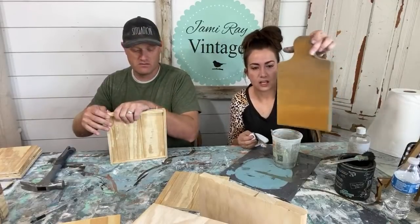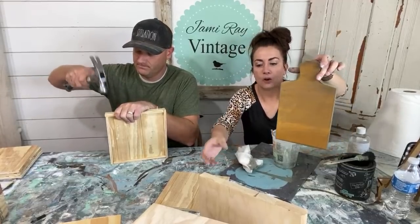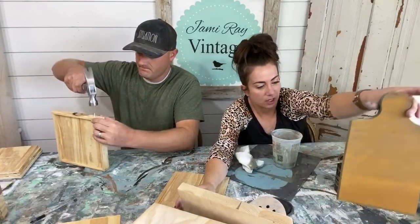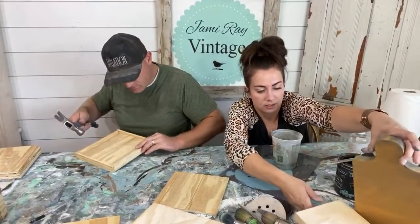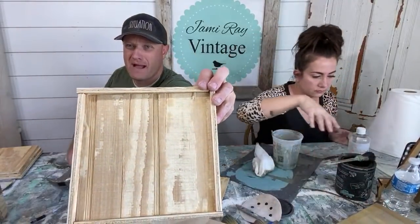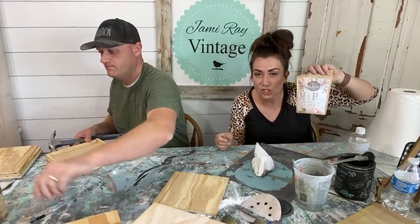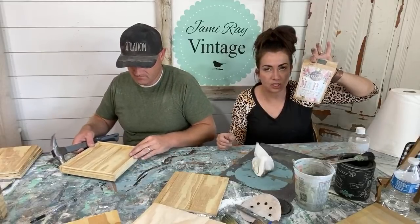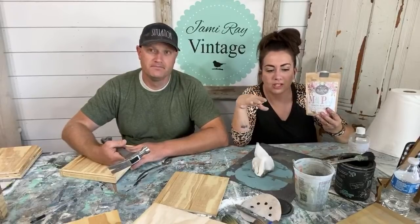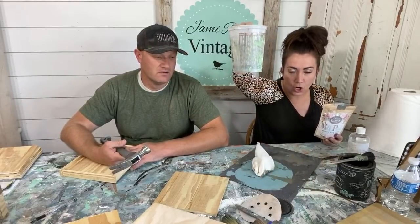We're going to let that dry — it will lighten up as it dries. You can make it darker or lighter; you can use black, brown, whatever shade of milk paint you want. This is unstained next to the wet one. This color is zinc from Sweet Pickens milk paint. You can also use Farmhouse Finishes to make faux stains. If you're making stains, you don't need a pint — just buy a little sample, that's more than enough. I put just a small amount of milk paint in the bottom and made this much stain, which is more than enough to do all of these here.